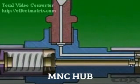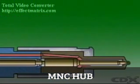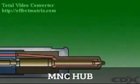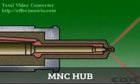The injection pump delivers fuel to the injector. The fuel passes through a drilling in the nozzle body to a chamber above where the needle valve seats in the nozzle assembly. As fuel pressure in the injector gallery rises, it acts on the tapered shoulder of the needle valve, increasing the pressure until it overcomes the force from the spring and lifts the needle valve from its seat.